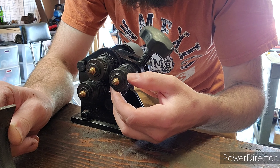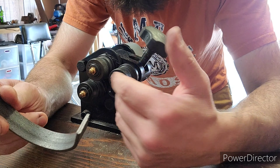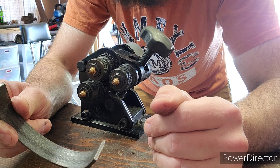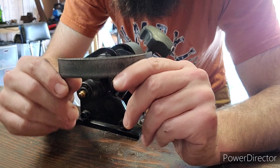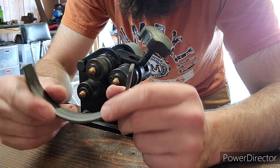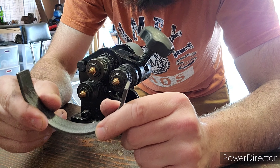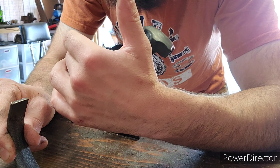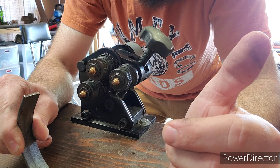Now the other disadvantage to this tool in particular - you can see how these wheels are knurled, how they have this grip surface on them. The point of that is to have more grip so as you move your steel through, it moves through easier. However, look at that surface - look how marred up that is. You can actually see all those knurl marks in there. That's not really something you want on a good finished product. So I am going to run a file over these surfaces to knock those knurl surfaces down and make this a little bit smoother.